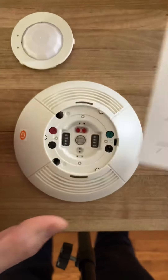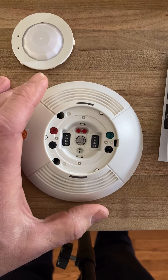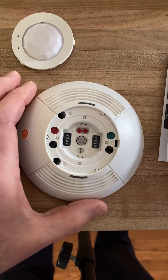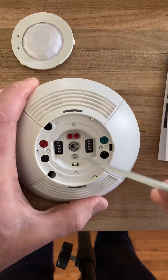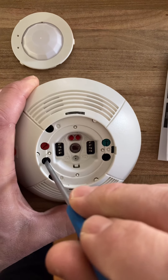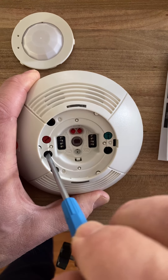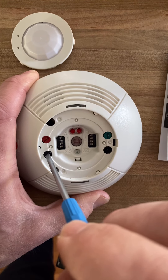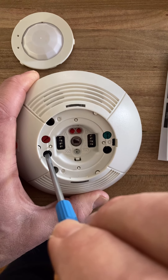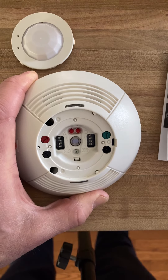The next one is regarding timeout. The sensor default setting sets its own timeout — it keeps track of how long people are in the space, how long lights are on, and adjusts automatically. If you need to set it manually, you're going to have to turn the B3 dip switch on, and then this black dial gives our adjustment over here. The dial goes from about seven o'clock to five o'clock. Minimum is eight minutes, maximum is 30 minutes. If you want to set it to 15, which is a popular setting, you're going to need to set it to about 10 o'clock.